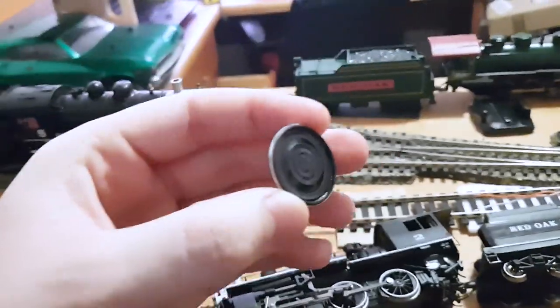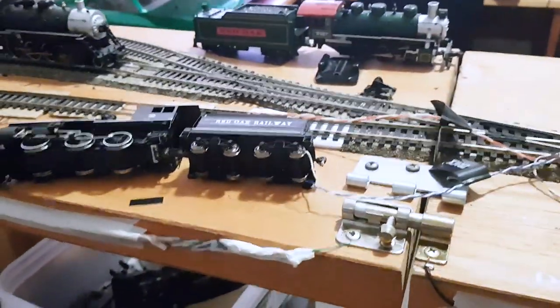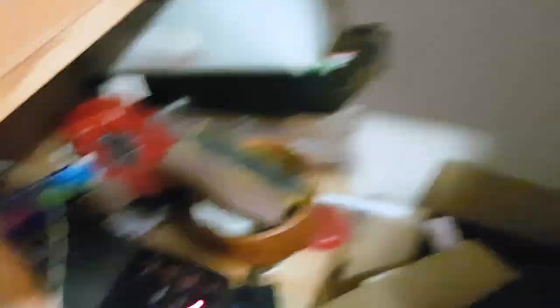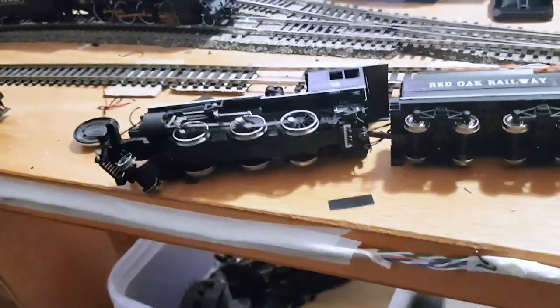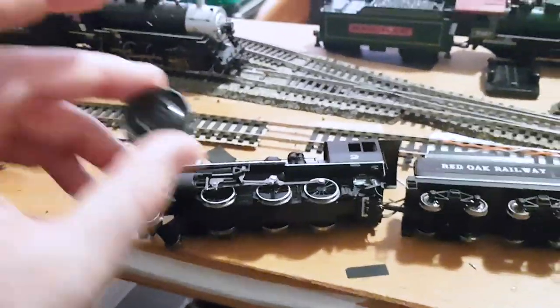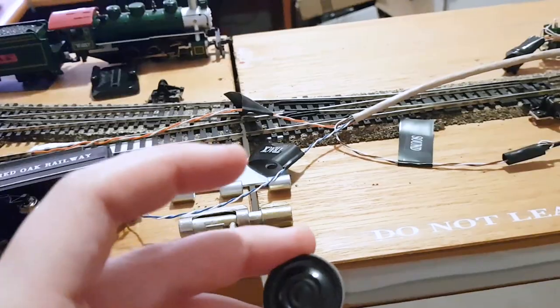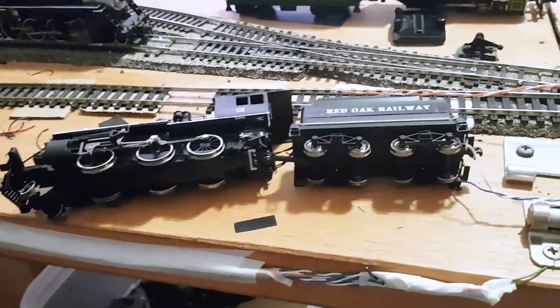The issue is that the speaker isn't hooked up directly, and there's now no power draw at all on the speaker leads because they're just going to the stereo. This decoder didn't used to be able to boot up until about 40%, but with the other big speaker attached the problem was that it wouldn't boot until well above 50% — by which point the train was already moving. Now that there's no power draw at all it boots up early, and for some reason won't stop until 20%. I think we need to connect the original small speaker in parallel with the output leads, so it thinks it's still in the engine and puts everything right.